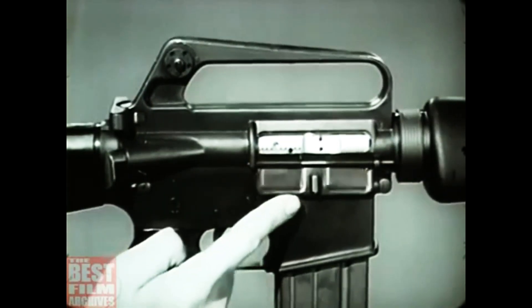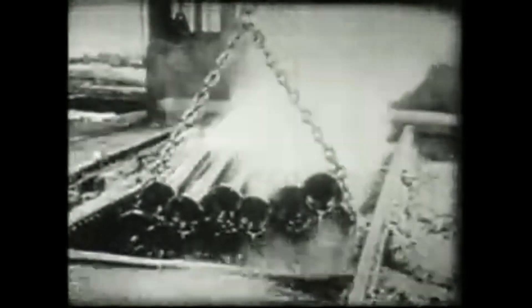While the alloy is important, the tempering process is equally as important. Tempering metal brings out its best characteristics, and usually involves heating, cooling, and quenching of the metal to achieve a balance of hardness to flexibility. In the case of both the 6061 and 7075 alloys, both are tempered at a rating of T6. This process takes in excess of 24 hours and involves several cycles of heating, quenching, and aging of the metal, which brings the aluminum and alloying elements together, producing the strongest possible version of that alloy.